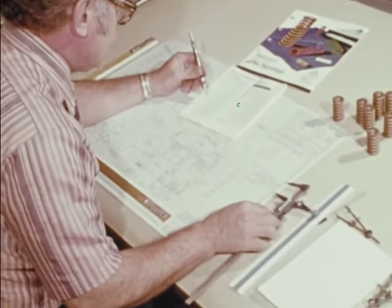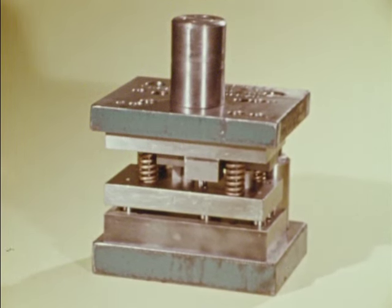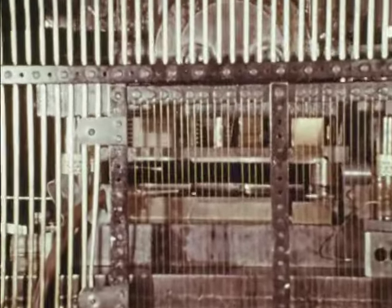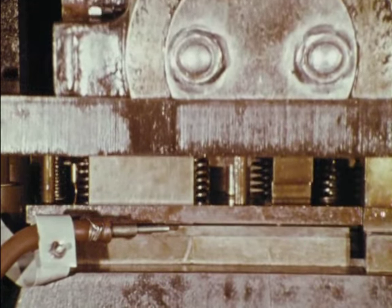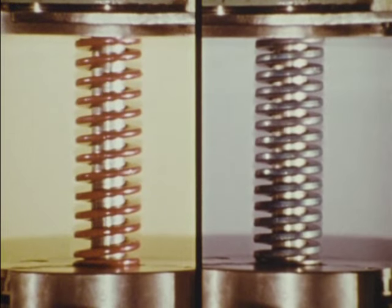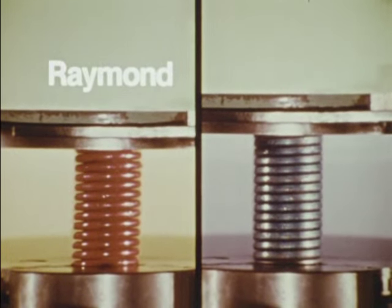Always select springs to produce the required load with the least amount of deflection. This will increase the useful life of the spring, reduce the chances of spring failure, reduce downtime, reduce lost production, and reduce maintenance costs. The more rapidly a spring works, the more attention must be paid to its fatigue limits. In slow-moving dies and tools, it is possible to get good performance with springs operating near maximum deflection. As the working speed increases, the life expectancy of the spring at that deflection decreases. Die spring costs are a very small part of the total cost of the die. An effort to save a few cents on die springs is a misguided act that can cost many dollars in lost time and labor.